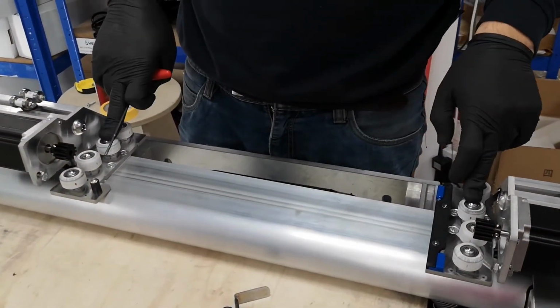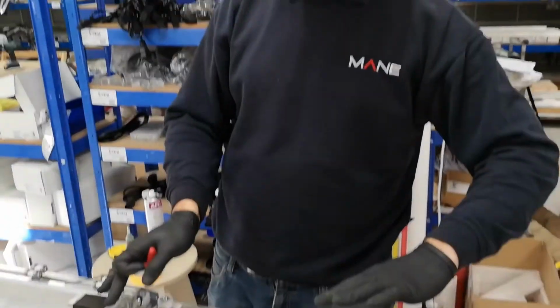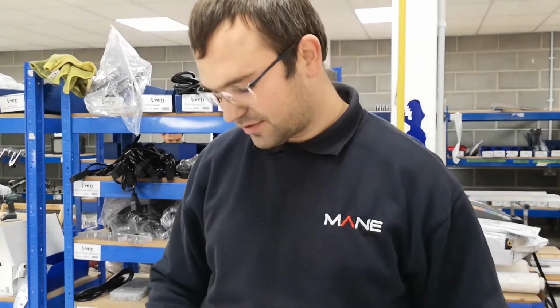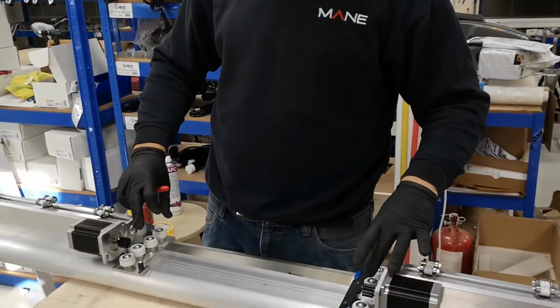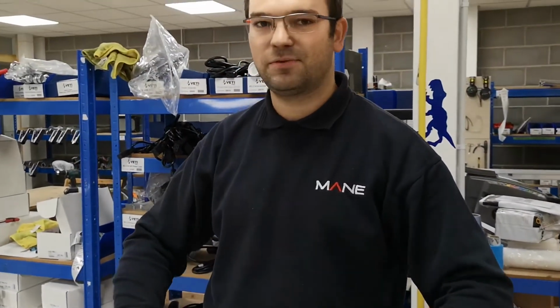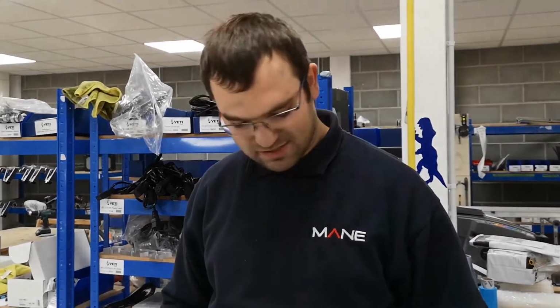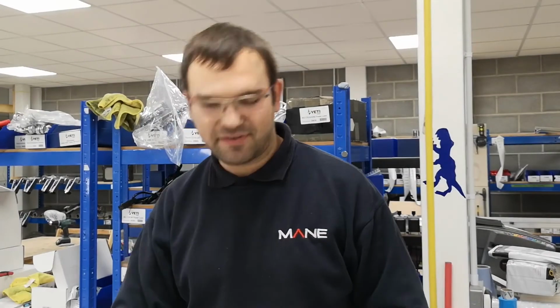You can do it from the back wheels, you can do it from the front wheels, or a combination of both, to achieve squareness. And then after you're happy with the squareness, you lock them down and you just adjust the remaining four wheels to that. And to adjust tiny differences, you can use the rear wheels just to put a bit more load to one side or the other, and that will square it perfectly.